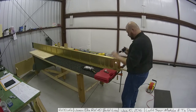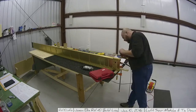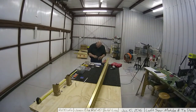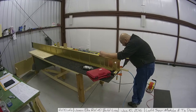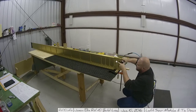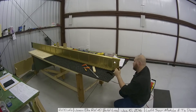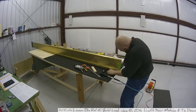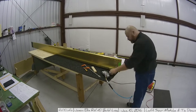Once you've seen a rivet thrown you've seen a rivet thrown, and that's a lot of what I'm doing — putting rivets and nut plates on. I will be better about close-ups going forward. One thing I want to show: towards the bottom, because the rivet is so close to the bar itself, I'm using a bucking bar on the metal and the rivet gun is actually pushing that bucking bar, while another bucking bar on the other side is doing the work of the shop head. Then I use the squeezer for the nut plates close to the edge — every time I can use the squeezer I will, for uniformity and end results.